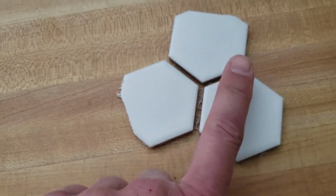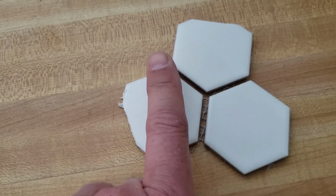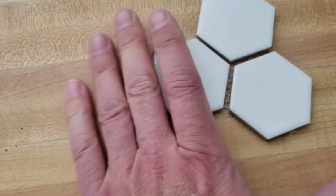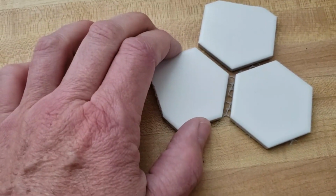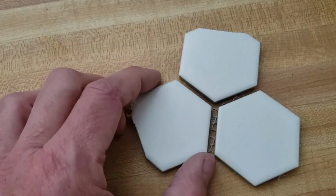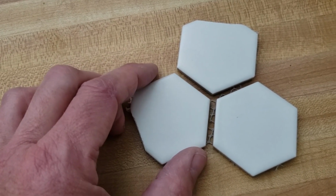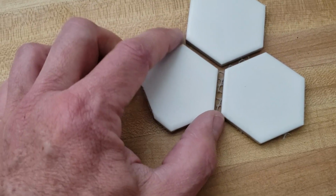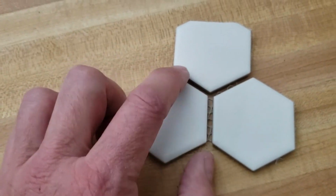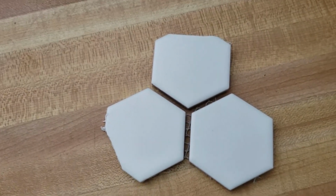And then I filled it in with white grout. And the white kind of obscured any imperfections in the gap size. So if these gaps are black, like if using a highly contrasted grout in between them, you'll be able to see minute problems in the gap spaces. But if you're using a non-contrasting grout, it hides a lot of tiny imperfections in the size of these spaces. So obviously the best thing is to make them perfect. Take your time and make them perfect.